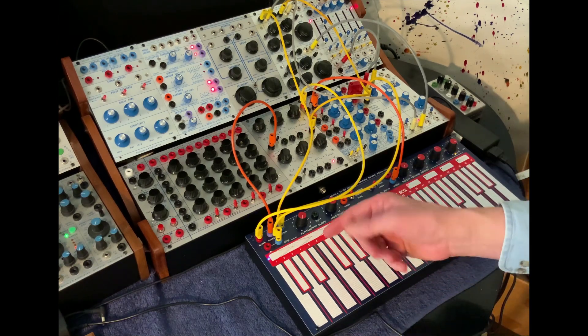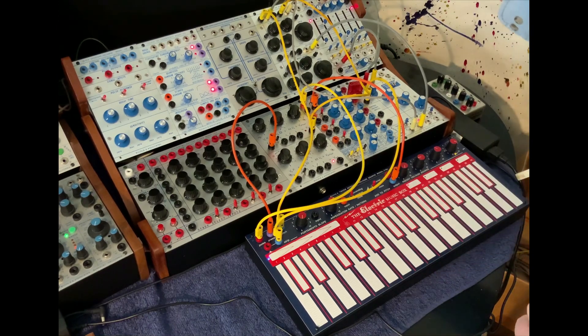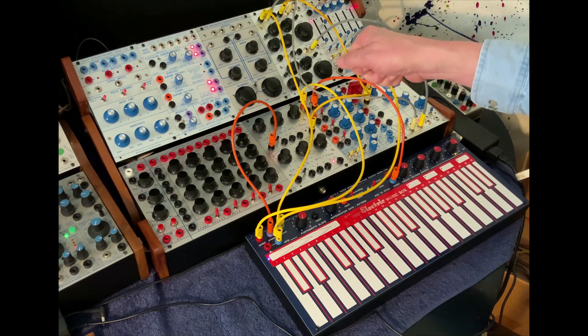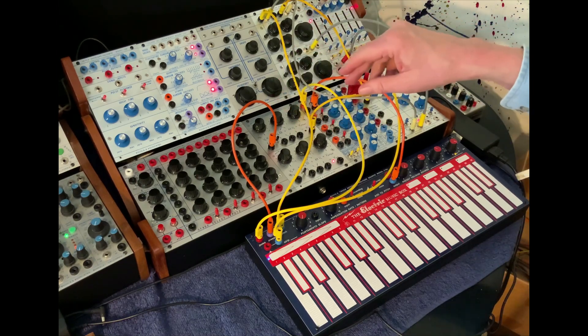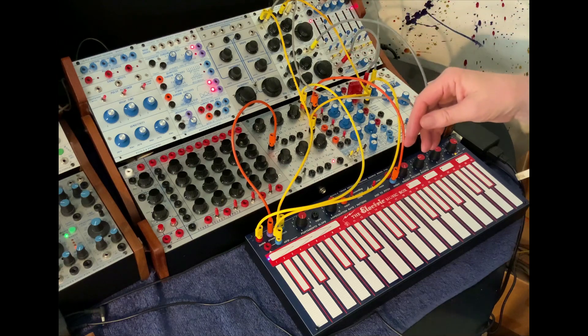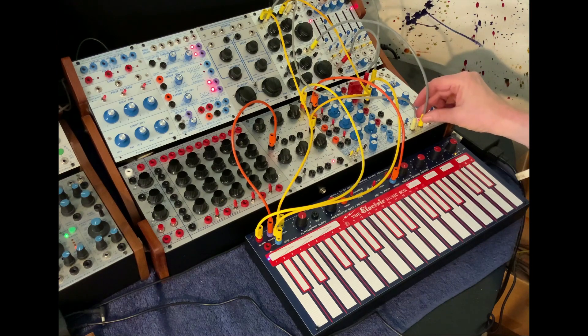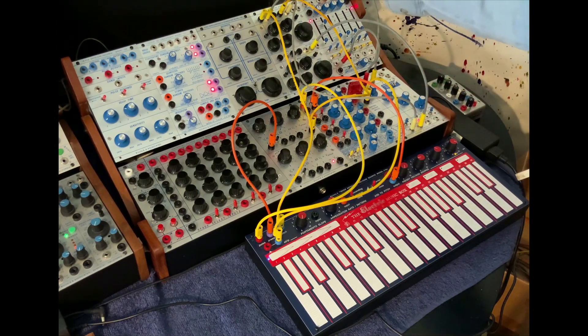What I have the ribbon going to — this is a fun little thing to do — since on a complex oscillator like the 259 you would have a modulation index, so if you wanted to do pitch modulation, basically FM, you just use mod index. But the way to do that with a 258 is I come out of the sine square, go into a 292, and have that output go to FM. The FM is open to where I want it to be.